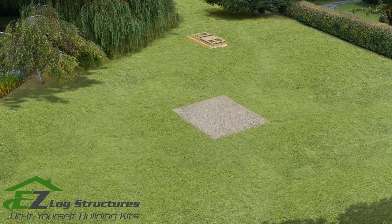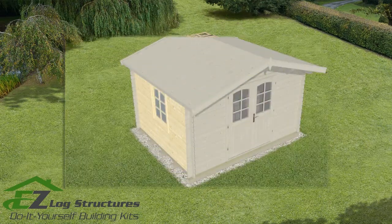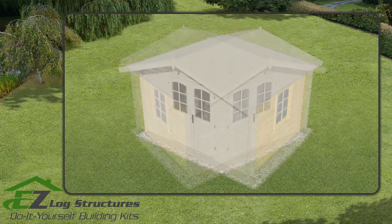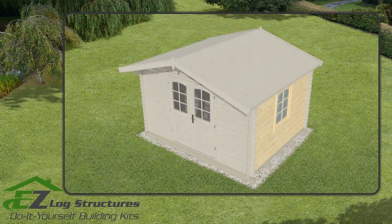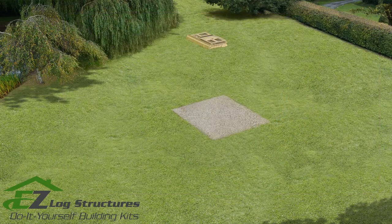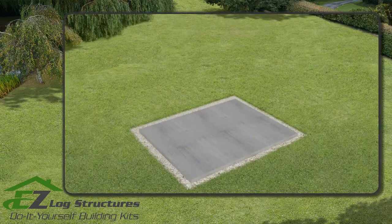Before you begin assembling the building, consider the building's location. Walls are reversible, so walls with windows can be installed on the left or right side of the building. Front walls with offset doors can be placed on the left or right by reversing the wall logs. The building can be mounted on a concrete slab or treated skids.